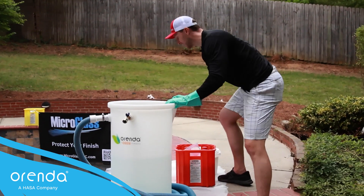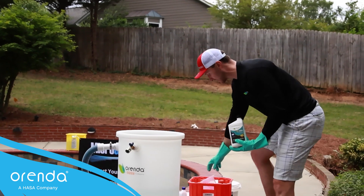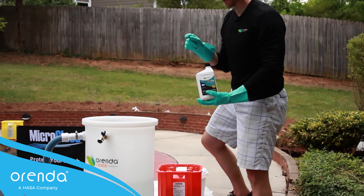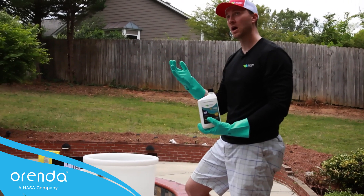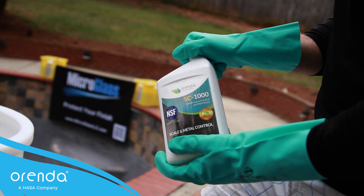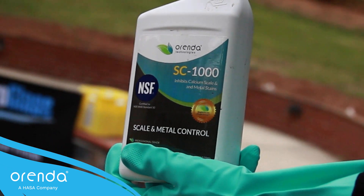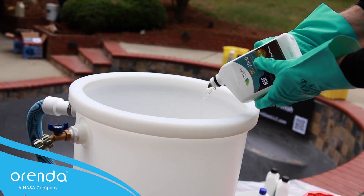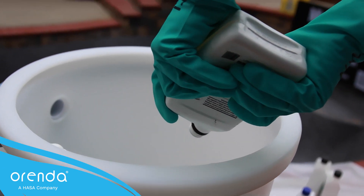When we use this product it has a higher pH and we're going to need to put in 12 ounces of muriatic acid per quart. I have my measuring cup right here. Since I'm using two and a half quarts, 12 plus 12 is 24, plus a half it's going to be 30 ounces — one quart of muriatic acid is what I'm going to need in this barrel. On top of that I need 18 more ounces based on the volume of the pool to reduce the pH, because I have low alkalinity so I don't need a lot of acid.